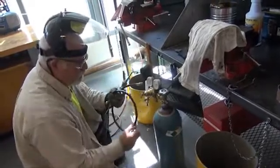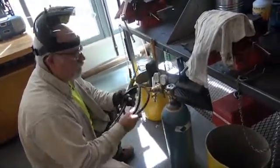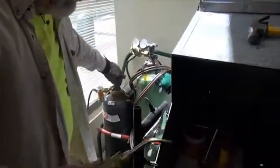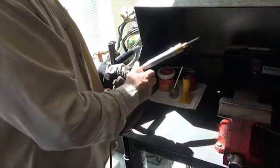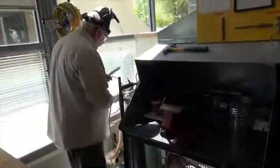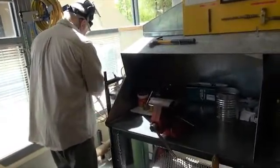You need to know those shutdown steps verbatim — don't try to BS your way through it. You can come down and practice before you have to do it. Get familiar with your equipment. The same thing with the acetylene: shut off the main valve, drain it, close the valve, then back off the working valve all the way. Put away the equipment so it's ready for the next student.